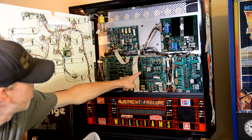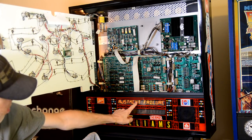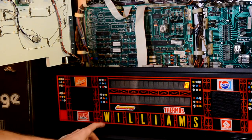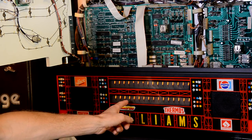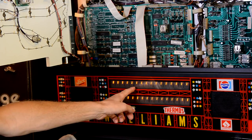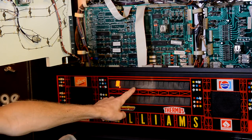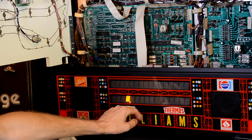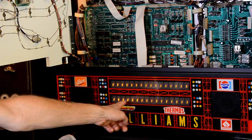The CPU has booted. We have adjustment failure on the screen, and we can see a couple of segments that look damaged right in the three digits that had heavy burn marks. Running through the display test: the bottom display is really good even though there were a couple of burn marks. The upper display is just toasted — all the other digits look fine, but those burned digits are really bad. The bottom display looks good throughout the test.